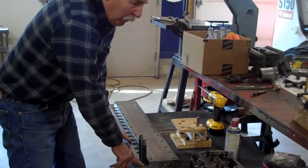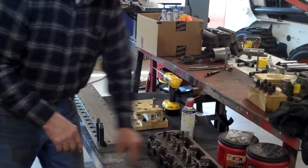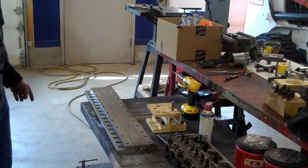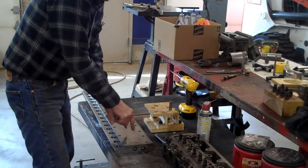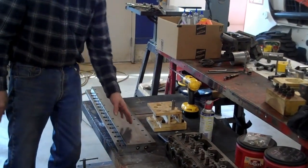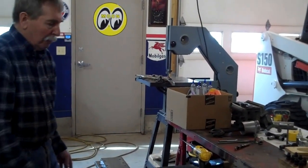Clamped to this plate first so that I can get a bore down through these holes, and done the bottom plate first so I can get them exactly the same as the Buick bolt pattern. Now the next step is to put this head on here and mark the valve centers down through the guides, and then drill those holes for the valve seats. This 1018 steel will make a good valve seat — it will hold up real well, better than the cast iron originals.